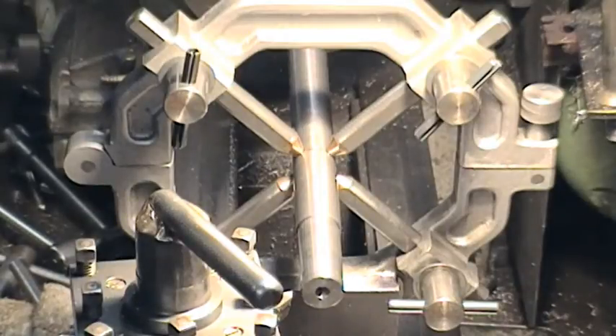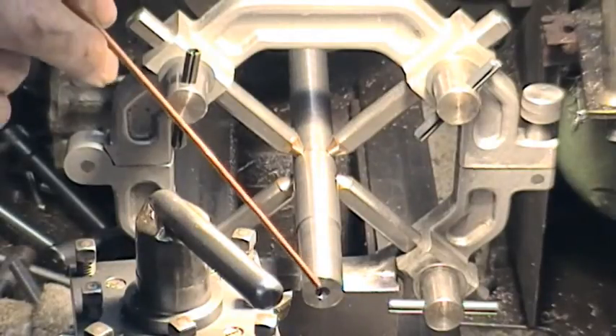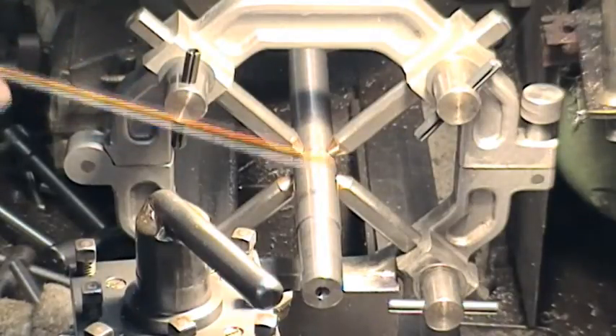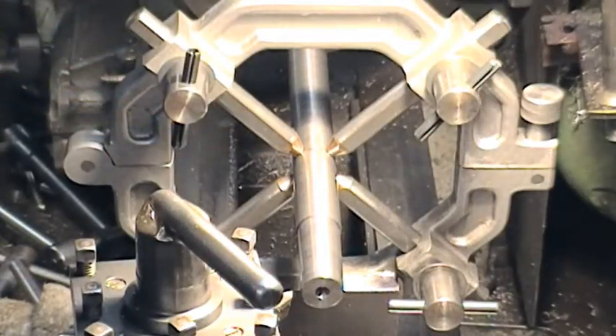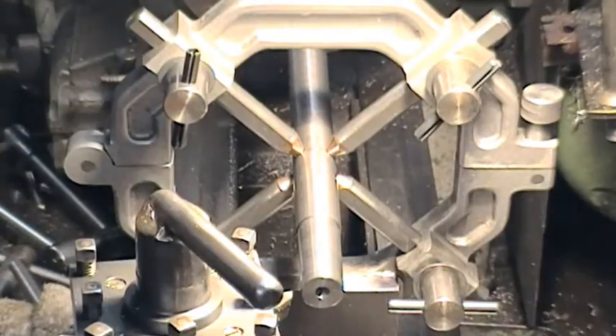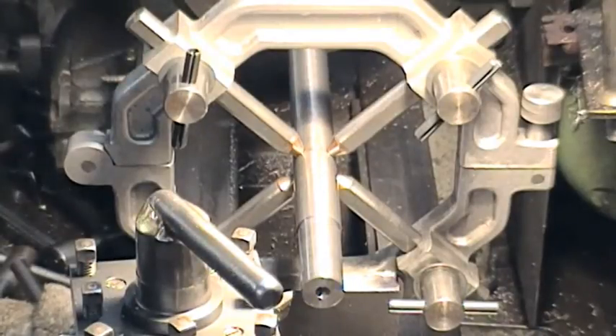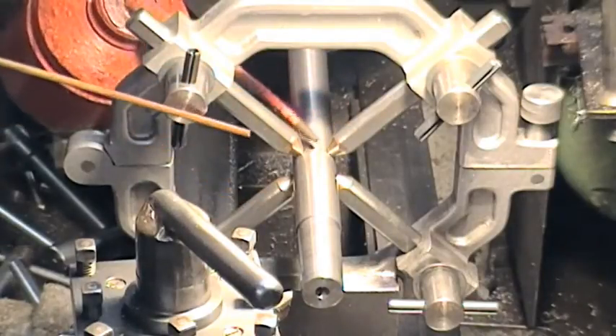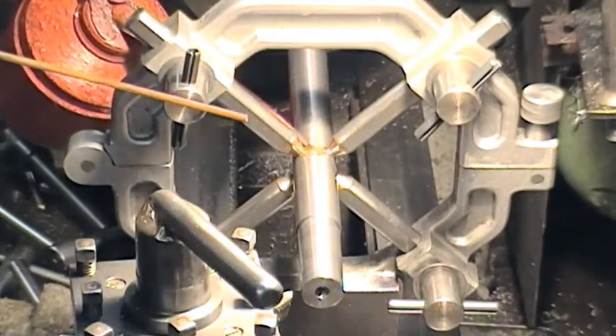After a considerable fight to get this thing organized — I'm trying for an end view here so you can see — I just want to do some work on that end. I've got to say this piece of bar has got a runout which is almost absurd. It took quite a bit of setting up to get this steady so that the runout here is at the moment probably three or four thou, and I can't go any more accurate because I would need a vernier control on these legs of the steady. Just going to put a bit more oil on there.